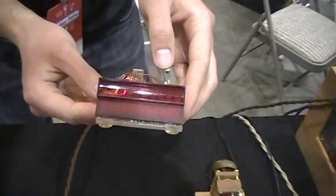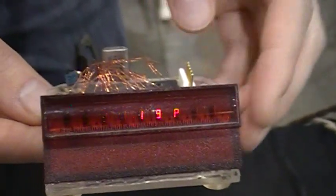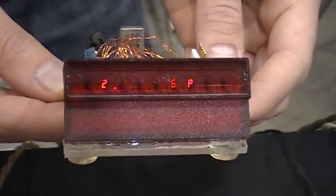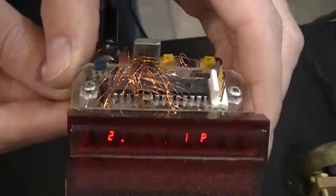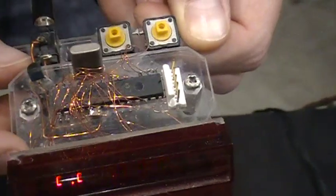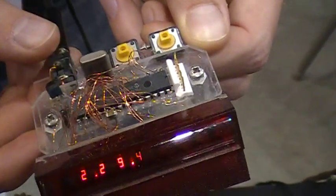This is an LED that you might see in an old calculator. The camera's picking up the scan of that — the scan is very slow because the device is running at 32 kHz. It keeps track of the time and has to multiplex the LEDs, but that doesn't leave a whole lot of processor cycles to do that. We've got a PIC microcontroller with a little voltage regulator. I like your prototyping here — it's drilled through a piece of Lexan and then air-wired together with magnet wire. That was just a fun little experiment to see what it would look like.